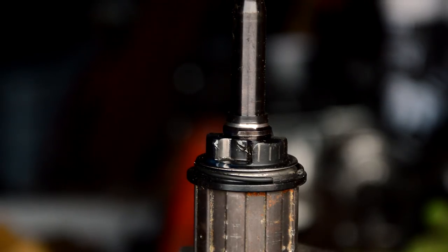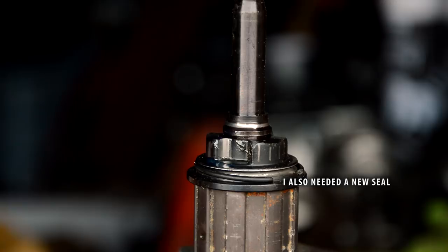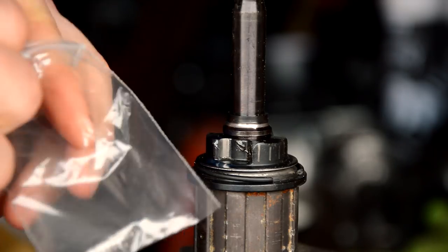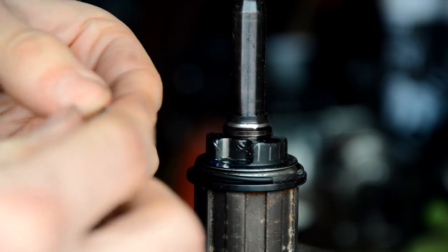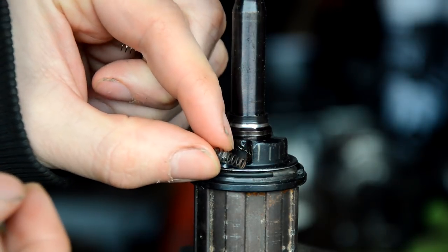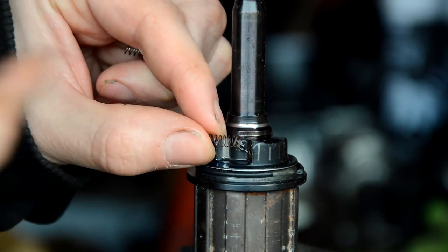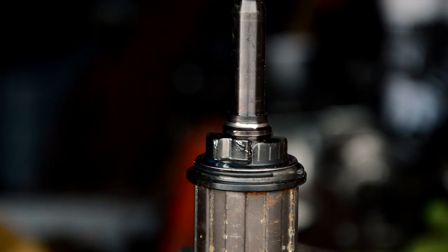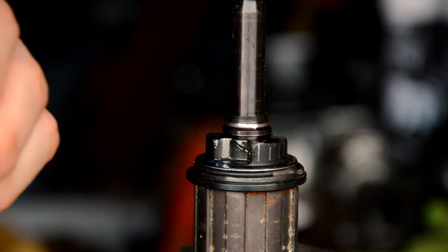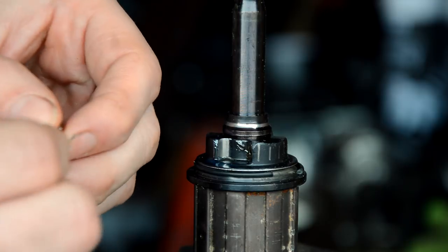Where I left off last time, this was all clean but I needed some springs — eBay sorted it out. Had to get some measurements: the old spring is a compression spring, around 12mm long, 3.9mm in diameter, with a 0.31mm wire. I've just dropped one — found it, I can see it. These are the new ones; they're a bit longer so I'm going to trim them down first, and then we can get to installing them.